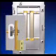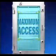The original design also had fixed terminal rails, which made access for cabling or connecting difficult, with the installer either catching his hands on the terminals or having to remove the rail to avoid this. So to make the box even more user-friendly, C-section rails are now mounted on threaded pillars welded to the rear wall of the box. The vertically mounted terminal blocks are fixed in such a way that they can be slid from side to side, allowing the installer to create maximum accessibility for cabling or connecting the conductors.